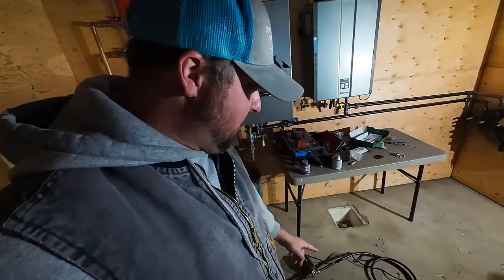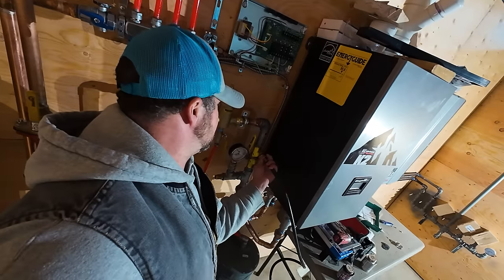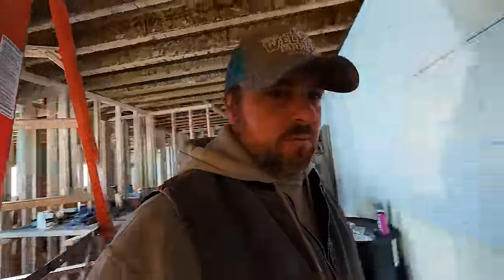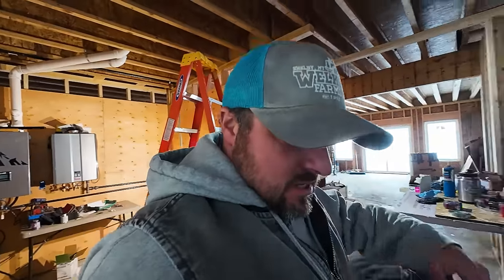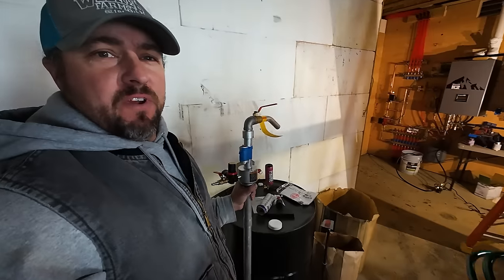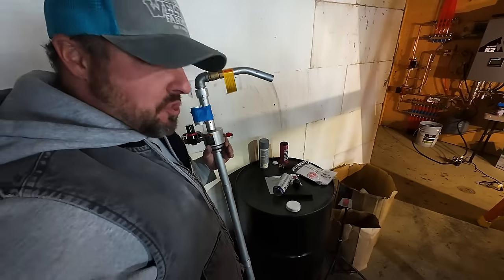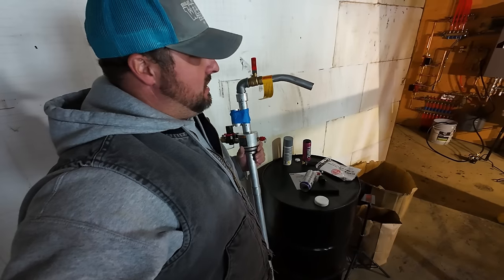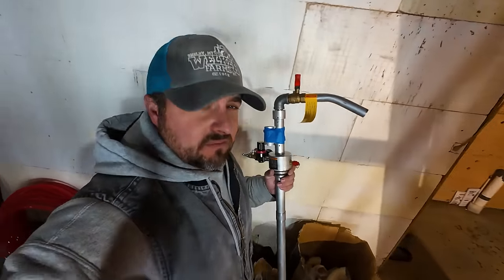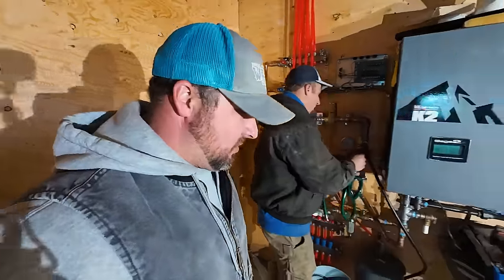Okay, Nick's got the pump ready to go. We've also got this nifty tool — you put it in a 55-gallon drum, add air to the drum, and it pushes the fluid through the tube. We use that to fill the bucket because we don't want to circulate contaminants from the drum into the system — that way we keep things separate and clean. We can move the drum closer rather than having to bucket it over.